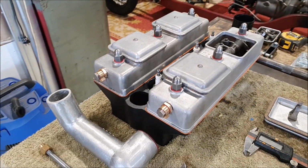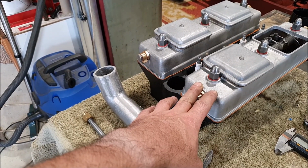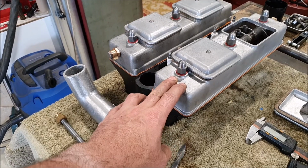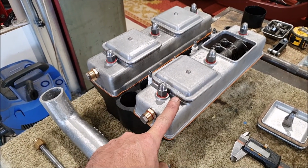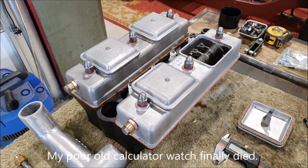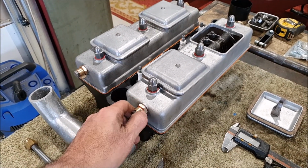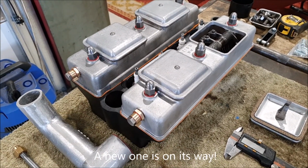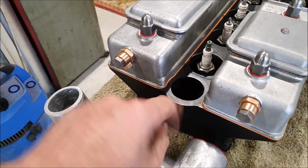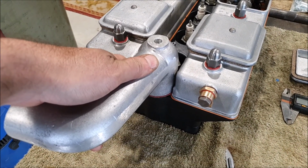installing the rocker gear in the head, and this will have to come off again, of course, because I'll need to do up the head studs. But the good thing with the Riley 9 is the rocker gear is attached to the rocker covers. So undo these 3 nuts and the whole lot just lifts off. But I wanted to get it all nicely assembled and get the oil fittings and all of that kind of stuff in place, all sitting on the correct gaskets. I did have to trim around the gaskets at the front here to make room for the water takeoff, which will go in there.